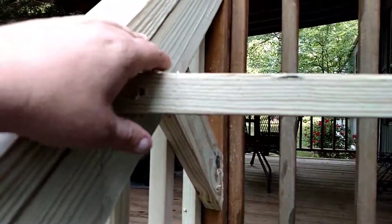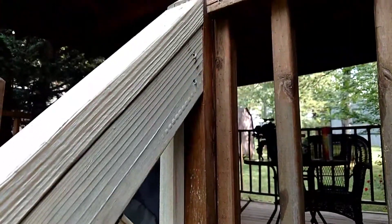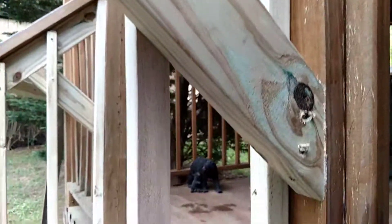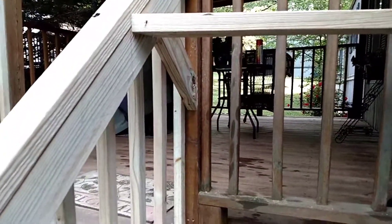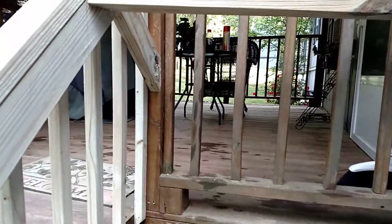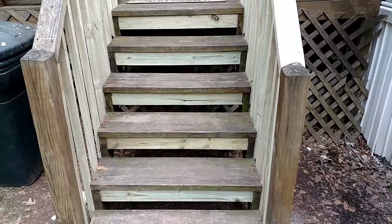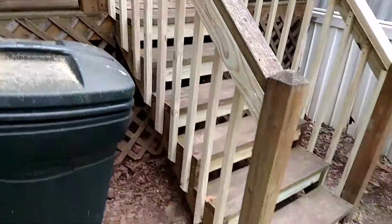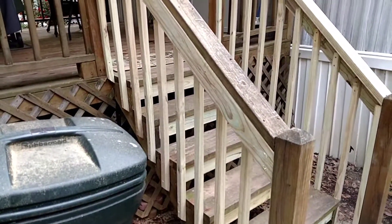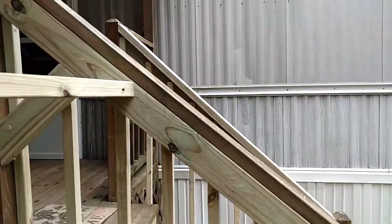This picket has blind pocket screw holes in it right here. I didn't want to put one on top because that just opens up a penetration for water. We put that little brace in there because this post is just nailed to the top — it's not done right, we know that. But it's sturdy; a 300-pound gorilla jerking on it isn't moving it. We screwed the pickets on the outside — should have put a board on the outside — but we stiffened up the handrail.